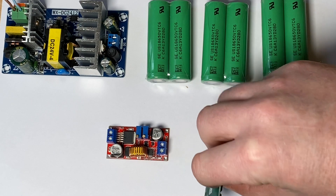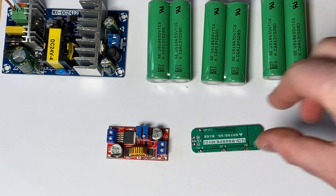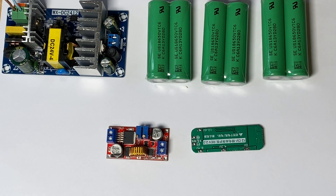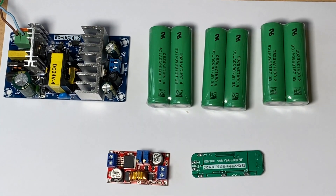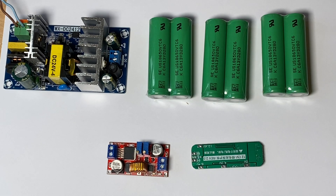You can see it's a fairly basic battery charging circuit, allowing us to get to 12 volts. And then when it's fully charged, I can run that through to the router itself. Now the router will also be pulling power at the same time, so the power supply at the top has to be fairly beefy to cope with powering not only the charging circuits, but also the router itself. So what I now need to do is build it and put it together, and I will film various steps on the way.